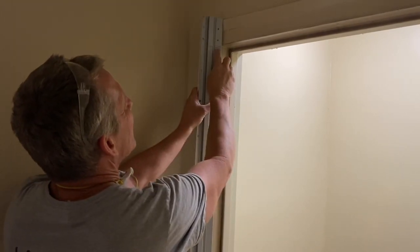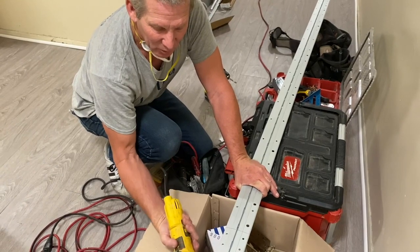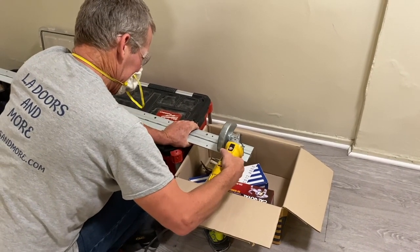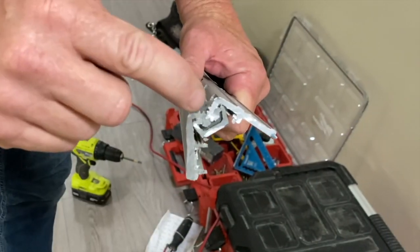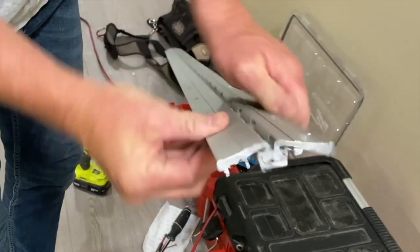So I'm going to cut this right here. I would recommend using an angle grinder with a fine cutoff blade. You don't want to try to do these with a hacksaw or reciprocating saw because you need a very clean cut. You want to make sure this thing still works — you can see the insides are gears, and that's why you want a very clean cut, because this thing still has to work.